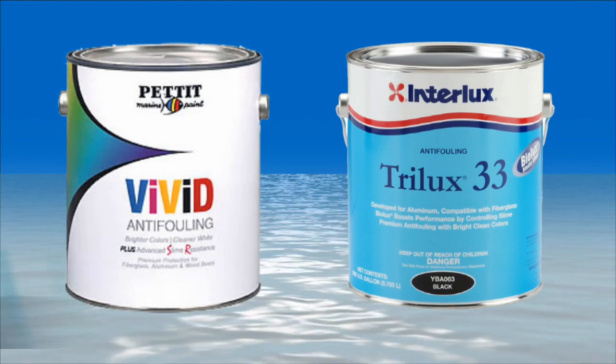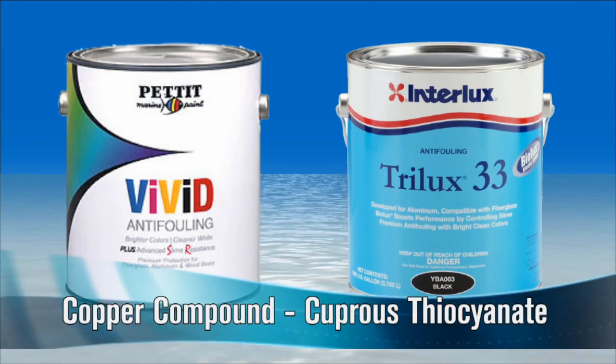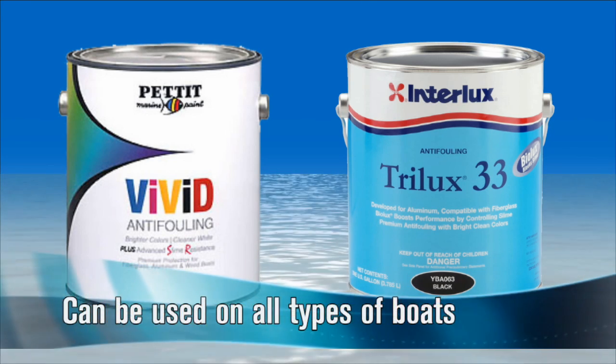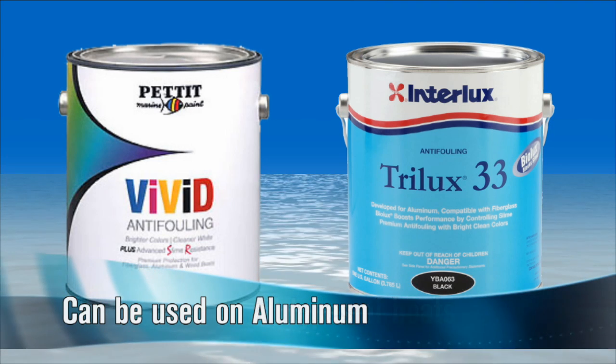Vivid and Trilux 33 use a newer copper compound called copper thiocyanate to achieve great anti-fouling protection, resulting in bright colors. These paints can be used on all types of boats as we previously listed, but are also the only paint suitable for use on aluminum.